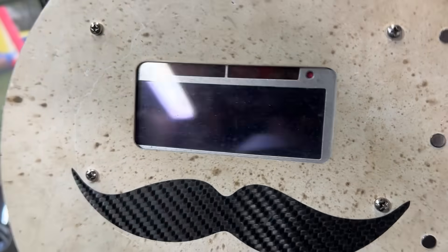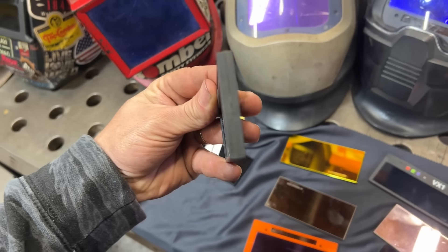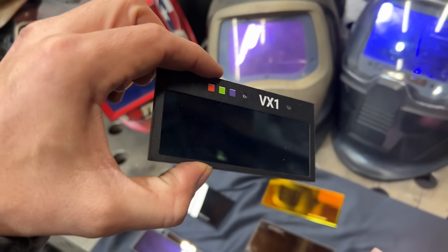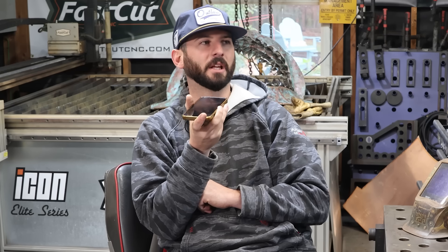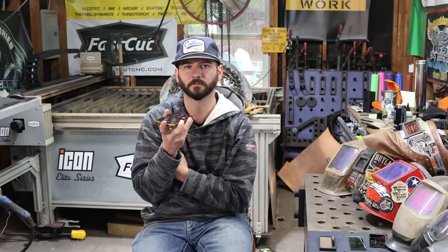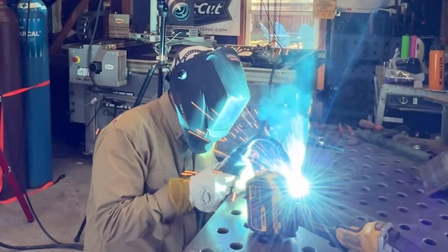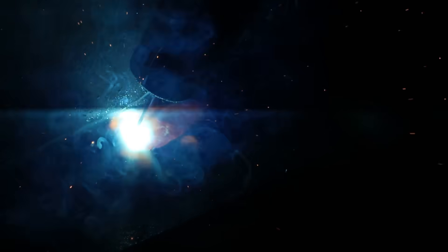When it comes to auto dark lenses, they're a dime a dozen for these little two-by-fours. How do you know which one's good? You have common circuitry and then you have industrial grade circuitry. When you're grinding, all that grit gets inside the circuitry — so that's why they designed lenses encased in resins. You can throw them in water and you're not going to get any grinding dust in them. The flashing issue depends on the positioning of the photo diode within the lens or the reflector in front of the photo diode. And a lot of these companies use cheap batteries — heat is a battery's worst enemy. That's why these welding lenses fail: the batteries just give out.